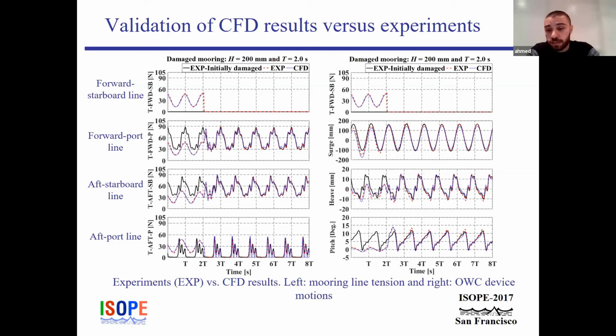And again, for this kind of device, which is an oscillating water column, you don't need the device to move quite a lot. Otherwise, if it moves with the waves, the relative motion between the device and the water inside the chamber will actually impact the performance. So you're actually looking at the relative motion. If you keep the device stationary and just rely on the water height inside the chamber, this would give more energy. But for other devices, you actually need the device to move, so a tension leg may not be the best choice for this. If that answers your question.